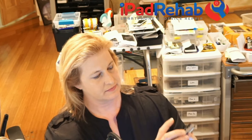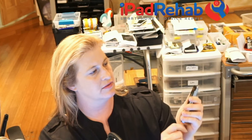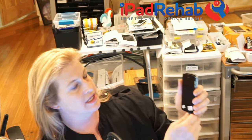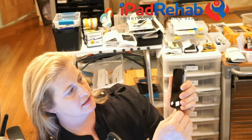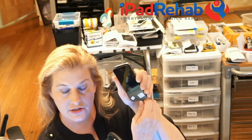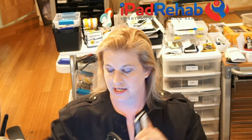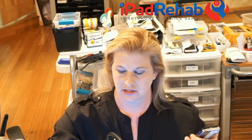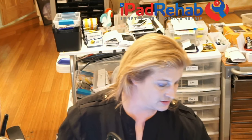All right. Okay, so this phone does not show the lightning symbol. Now we're going to unplug and plug it back in, and it makes no sign of any of that. So it does not wake up in response to the lightning connector. It acts as if it has never heard of a lightning connector before, and it continues to pull zero charging volts. Let's see if the computer can detect it. I'm gonna guess no.